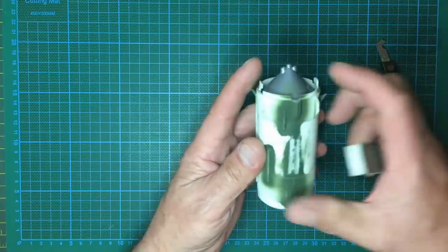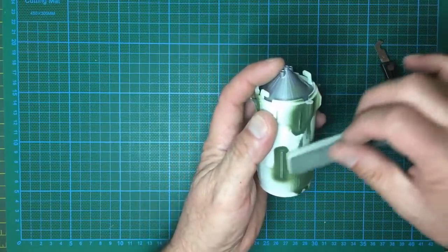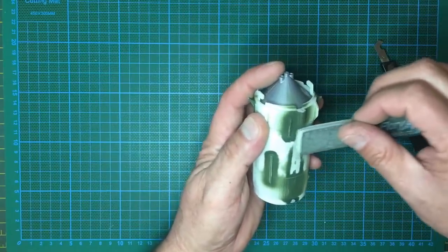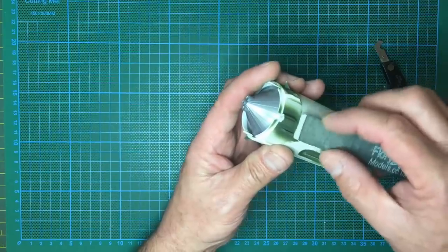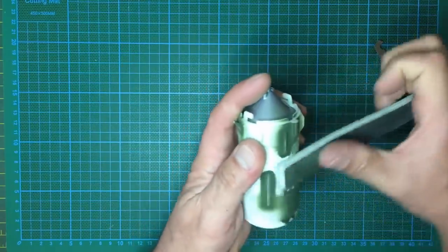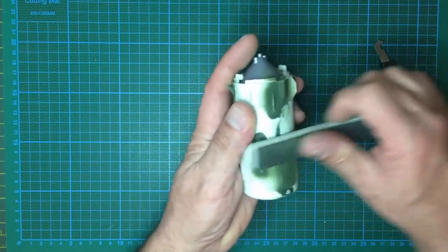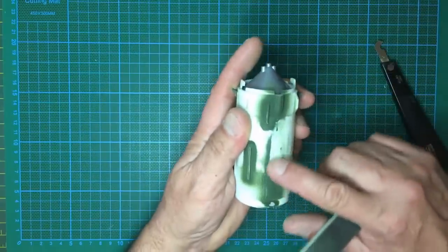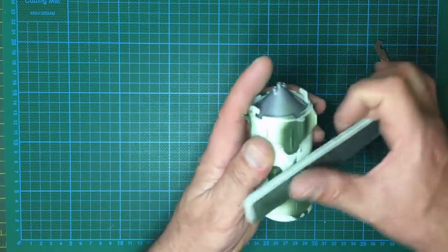And you can see when you go over here, you'll see tiny areas of green paint remaining, and that is where you've got a slight undercut, but it's so small you can't see it. And now I've gone this side, this is the polishing side, and I can basically now polish around that, and as you can see, the green paint disappears from everywhere once you start polishing.